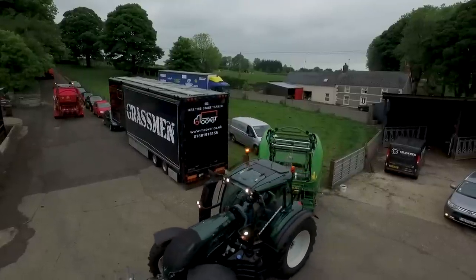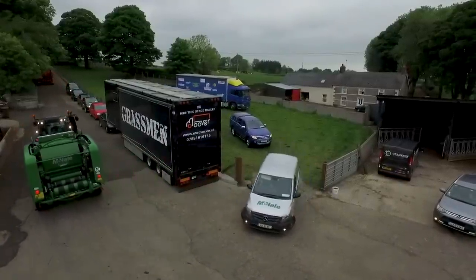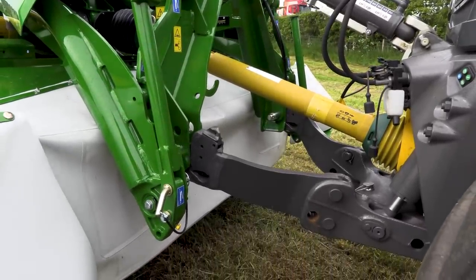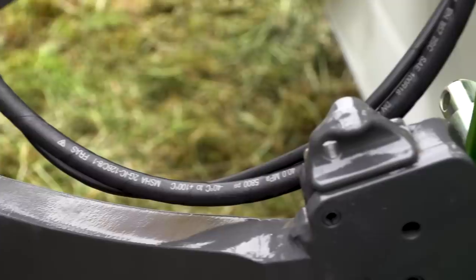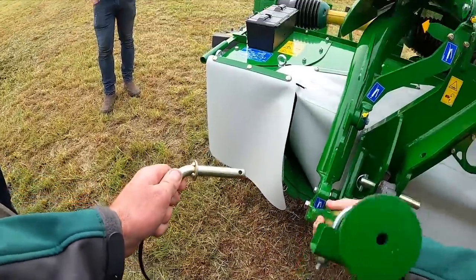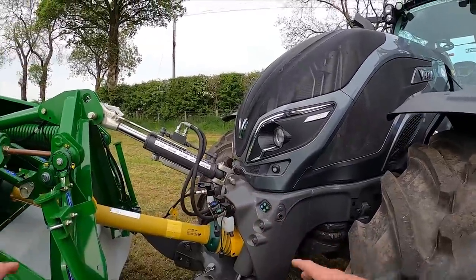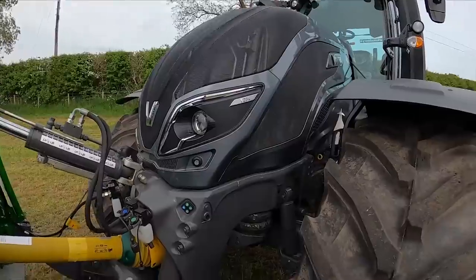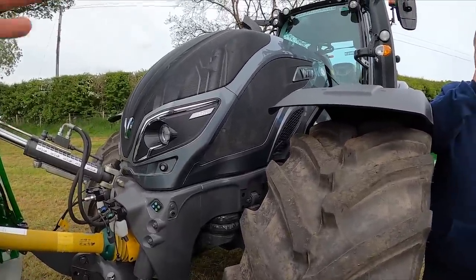The gearboxes come from the same supplier we use for the Fusions and balers — it's simplicity, companies we know and trust. Starting from the headstock, we use no A-frame on the machine — it's totally into your linkage arms, hook on your balls and down with your top link. You have one single-acting spool to work your mower up and down. Setting up your mower, simplest way is to use your parking stand, roughly 50mm off the ground, then lock your lift arms in position. There are no check chains to connect. That's the mower set up — no A-frame, just drive straight in. That keeps it simple and keeps costs down.